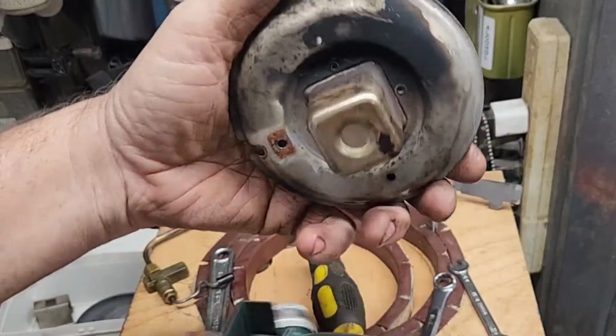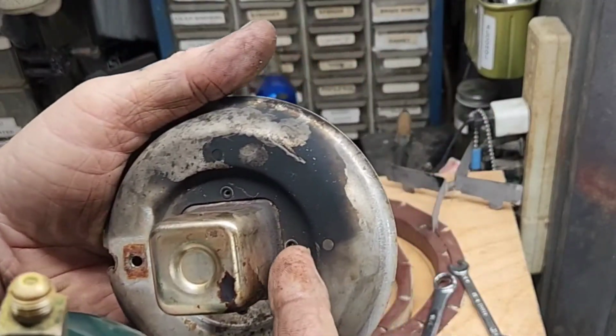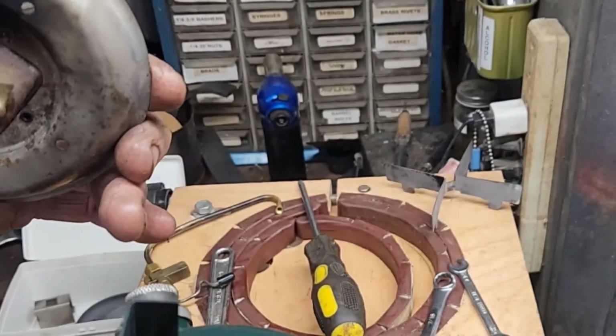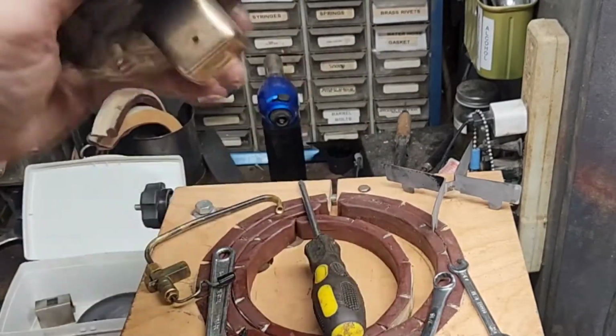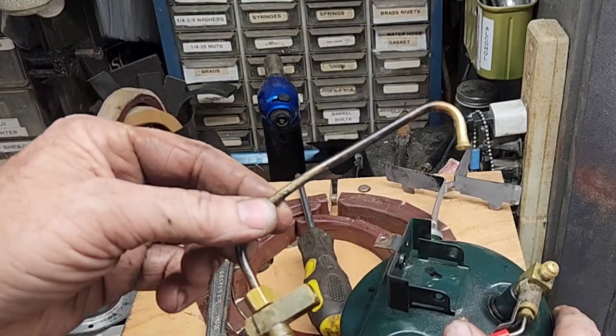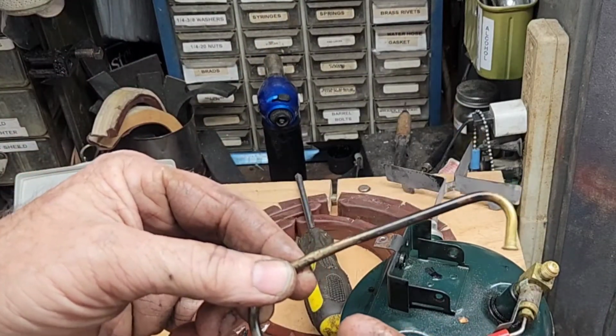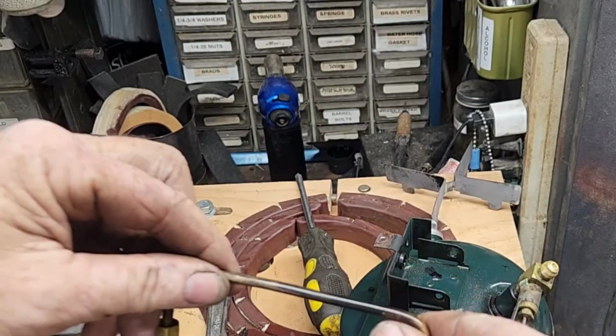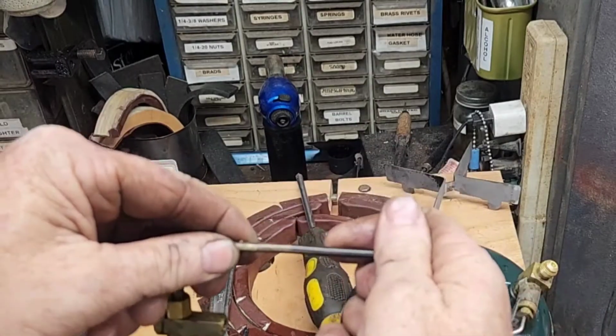Now that just lifts out. You can see the black under that burner bowl. So that generator has not been tight and it has been leaking. This style of generators, they're bad for that. They will leak around the generator and come up around the bowl. If you don't get them in there tight, you've got to kind of bend these back down.